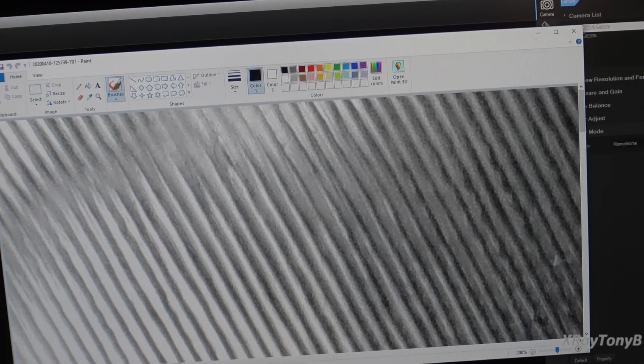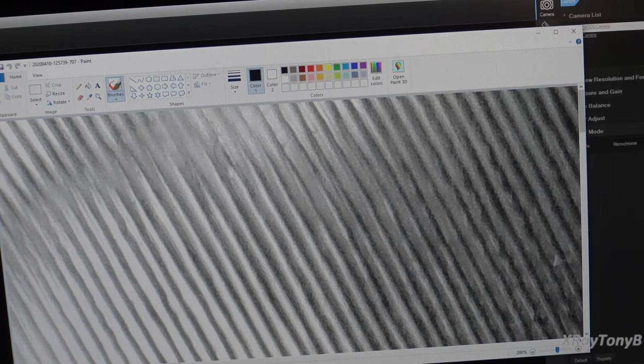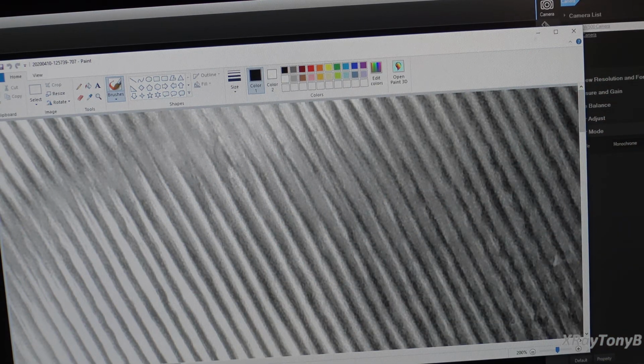And the reason they do that is to be more consistent with the groove. You can fit more information and make a narrower groove on your record, so that makes them play longer. And it also helps to eliminate other noise. If you have a really wide groove and there's a lot of gunk in that wide groove, it's going to create a lot of noise. So this is also going to help a little bit with noise, but it's also going to create a few other problems. So everything's a trade-off with this.